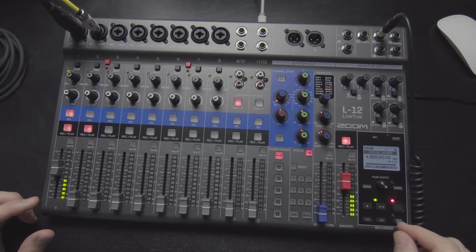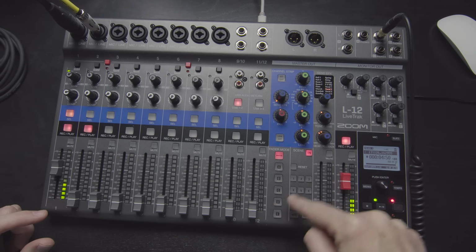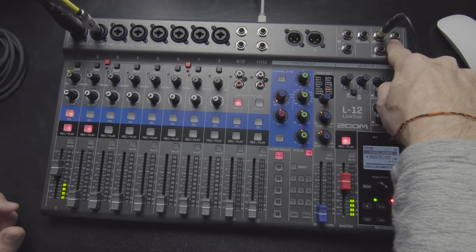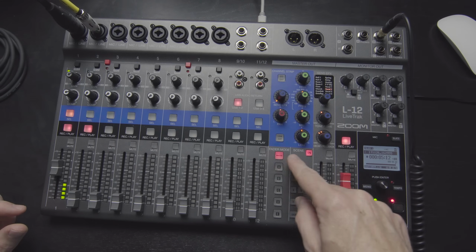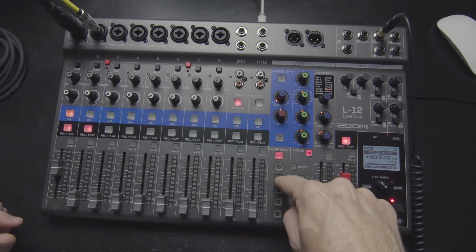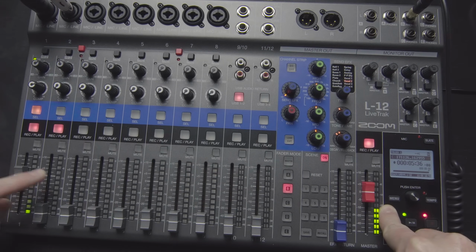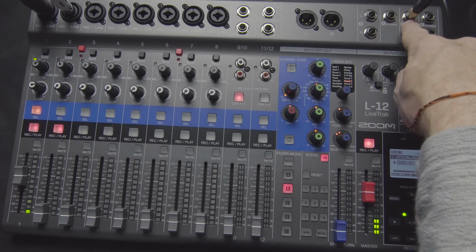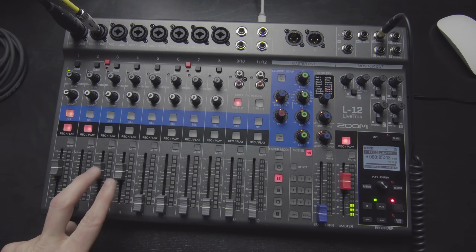And how you go about choosing these outputs and different mixes for them, this is where a digital mixer gets a little confusing. You have this routing section here, A, B, C, D, E. You have 5 different setups, one for each of these outputs that controls all of these inputs separately. So in the case of using this B as your auxiliary send for your mix minus, you would go to B. This is channel 2. Their fader would come all the way down. My fader would be up to wherever you want it set so that they could actually hear it in the mix. But on this channel, they're not getting anything. So you can output B to the computer without them hearing themselves. And then any other channels you want to send to them, you bring those up on the fader.